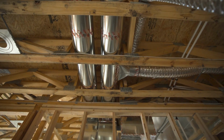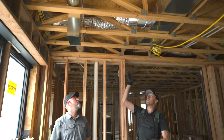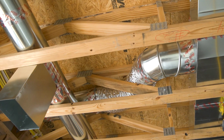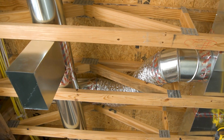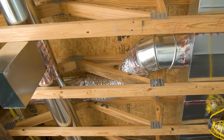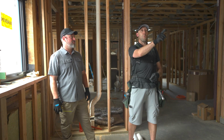Yeah, it's a win-win because as you can imagine, coming off of the trunk and then being able to go through a truss, up and over another pipe, that's very challenging with hard pipe. You're basically into a minimum of 4 fittings plus the boot. And there's friction loss in fittings too. That's true. We're still dealing with a very high efficiency system. This house actually has 2 different systems, one at either end.